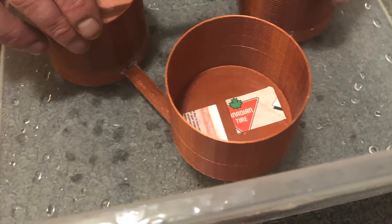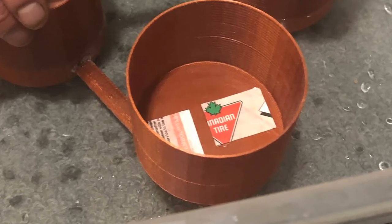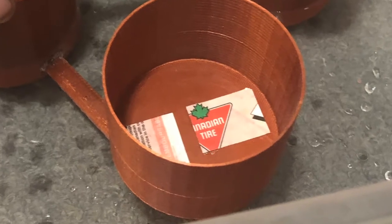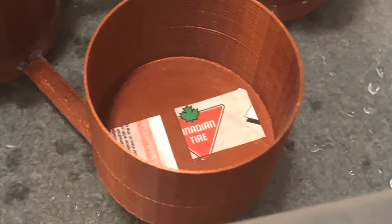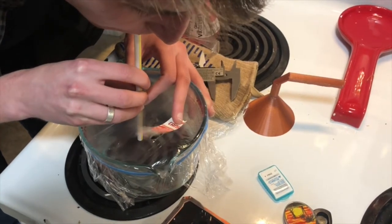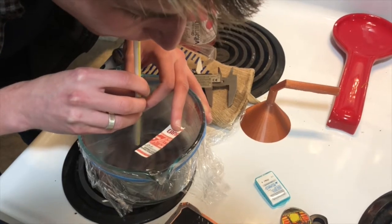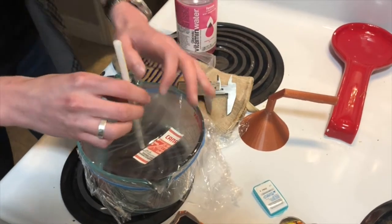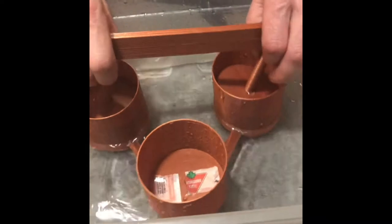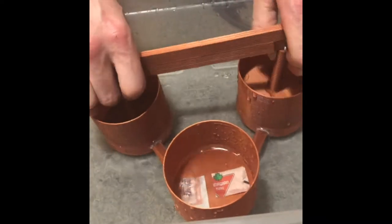The last component are valves — four in total — and these were not 3D printed. I created them by layering silicone onto a thin sheet of paper and gluing one end above a hole. When air is blown into the chamber it lifts the flap. When water stops flowing into the chamber, the valve closes by gravity and the weight of water above it, preventing backflow.